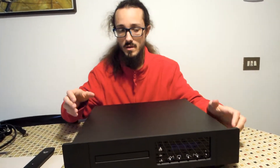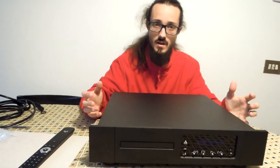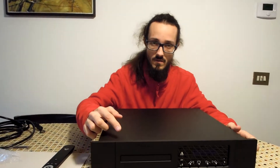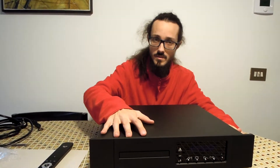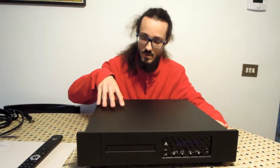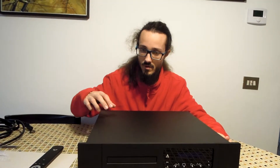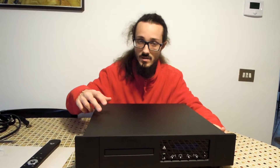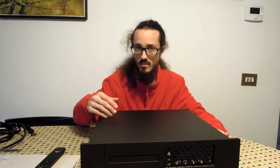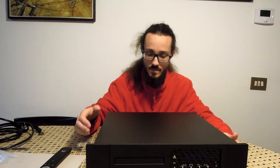The inside is very beautiful and the engineers have done a good design. On one side we have the Philips mechanism, which is appreciated by audiophiles. Here we have the power section — we have three transformers: two are for the analog parts, one for right and one for left, and the other one is for the digital parts.